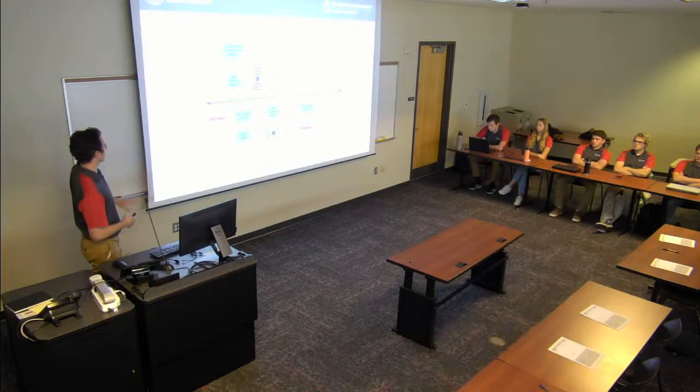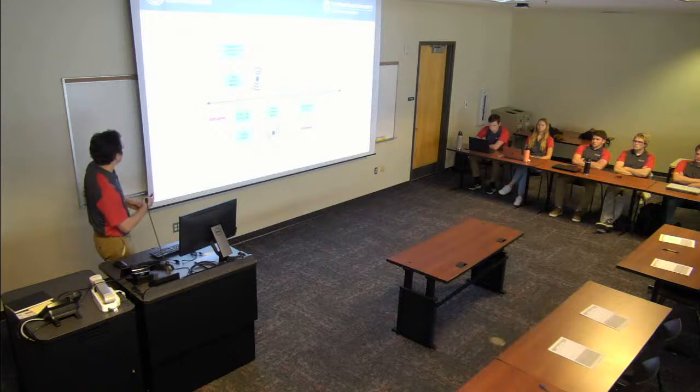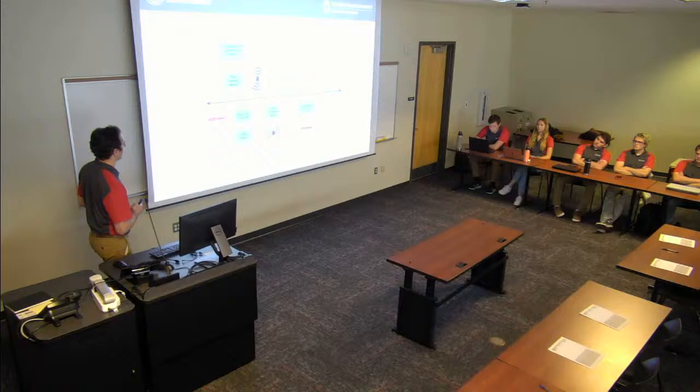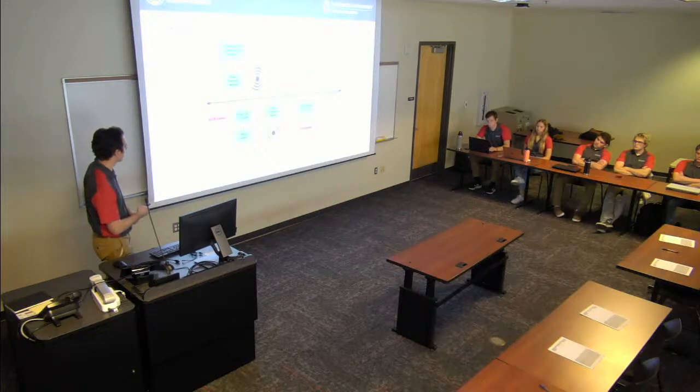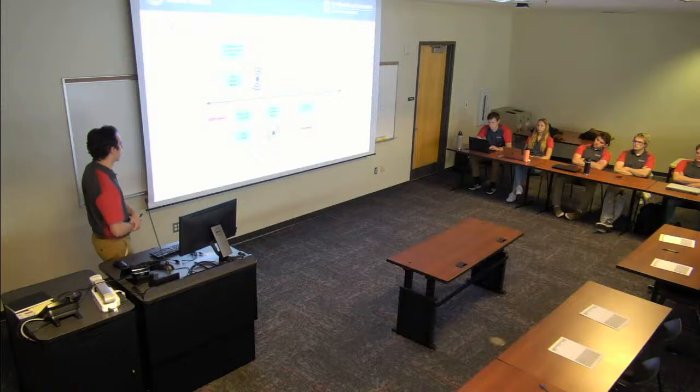So now I'm going to give a general system overview, and I'll get into more detail about the specific components in a little bit. So the first thing I'd like to start off with is up here. So the rocket and these systems can mostly be controlled from the ground. So on a computer, we have a ground software which we are researching and developing, and this connects via USB to a radio modem, which can communicate with the rocket. So there's a connection there. And specifically what this radio connection is for is to send arming commands and also to receive telemetry data.